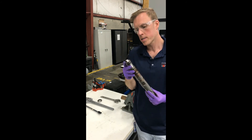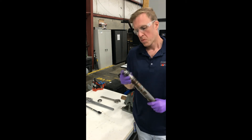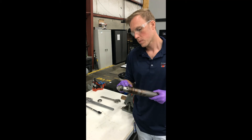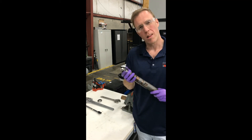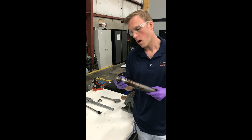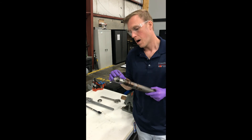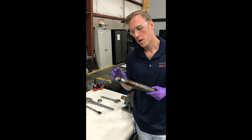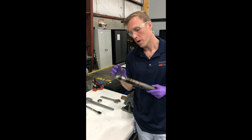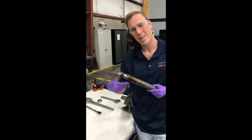Once you remove the poly packs — a word of caution here — this is a stainless steel cap on a stainless steel shaft with red Loctite on it. Oftentimes these threads gall terribly, and when they gall, the cap and shaft become unusable. If you have to remove the cap, the best thing to do is heat it, bring it up to temperature to break down that red Loctite, and then break that cap off.